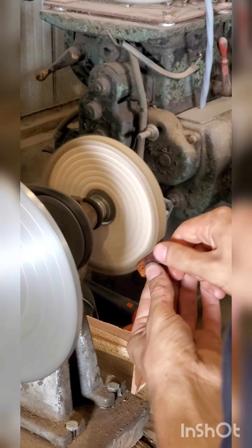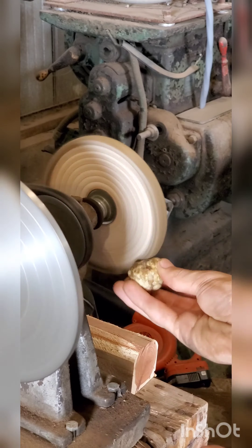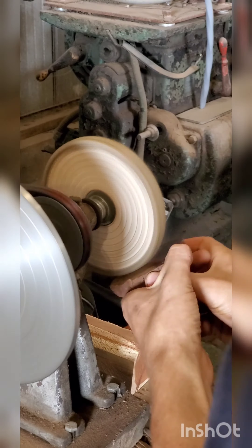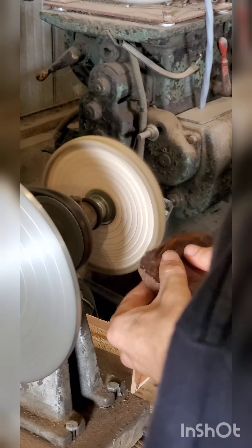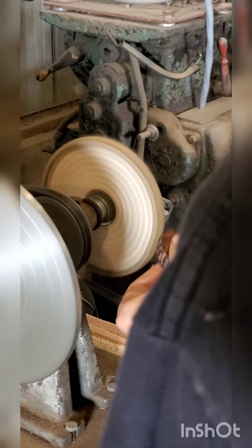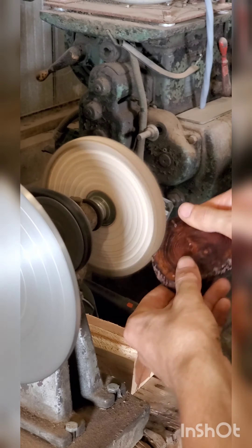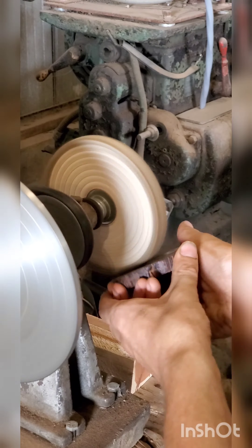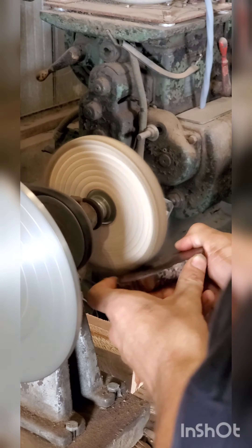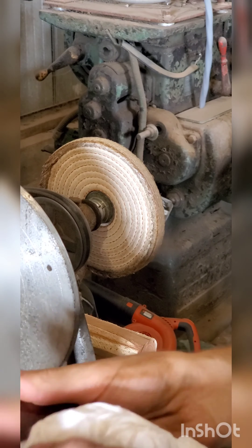There's a little bit of propolis and all sorts of stuff in it — it's really good for the wood. The propolis is good, that's why I use it like this with all those extra components. It's not pure filtered beeswax — it has a lot of natural preservatives in it. But it's a really thin coat on the outside of the wood because Osage Orange is so dense it doesn't absorb very much. So if you buy this, you might want to put another layer on every once in a while.